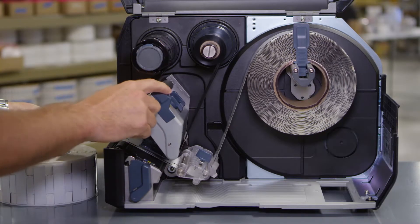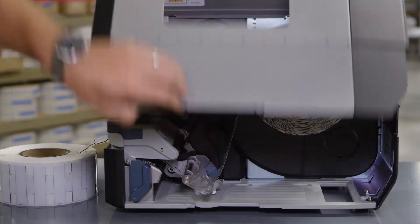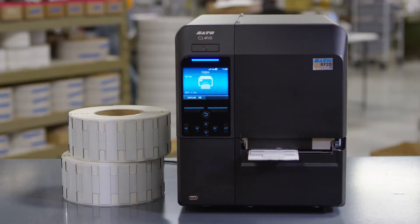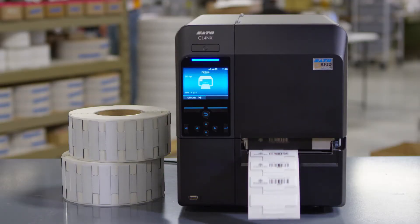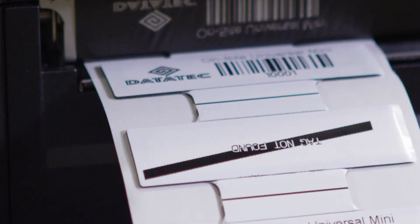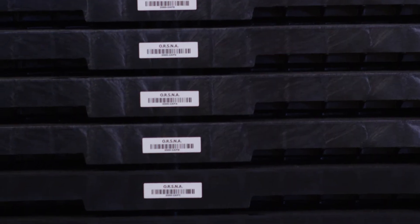Make sure that the end of the media extends out the front of the printer. Press the print head down until the headlock lever is locked, then close the printer cover. We advise printing and encoding a single label to test calibration. Remember to put the printer into online mode to print. Watch for tags marked void as they will not read. Once tested, you're ready to produce your RFID tags on-site.